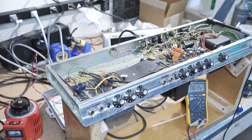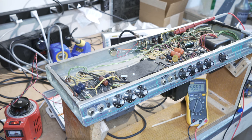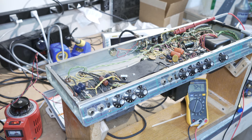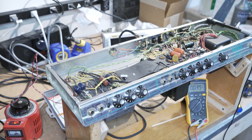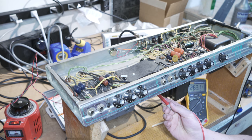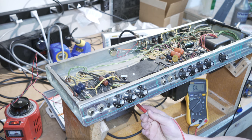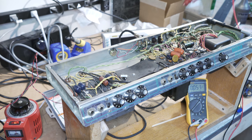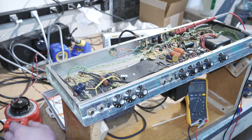So what I'll do is put this back on so I can see what my AC voltage is. Switch it back to AC. And we're sitting pretty at 60. So I'll bring it up a little more. 72. Now there's a whole new set of capacitors down here as well on the bottom side. I can definitely switch to DC volts. You can't see what I'm doing here, but I'll touch that one. It's at 263, 262, 250, 228. All right, so those are all within kind of what I'd expect as I'm slowly coming up. Nothing up in some crazy amount or down to zero. Back to our AC volts. Let's see here.